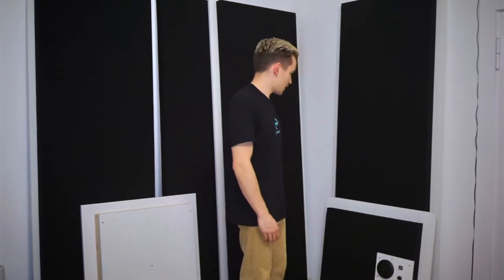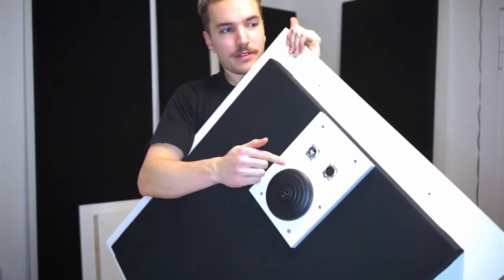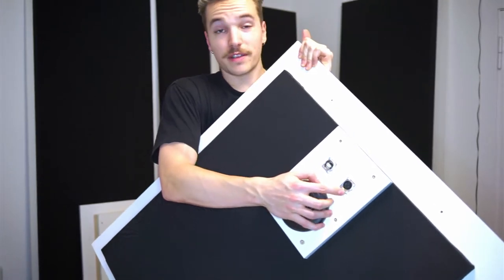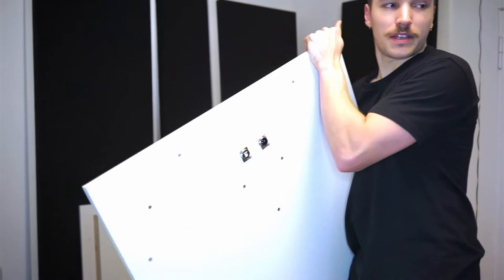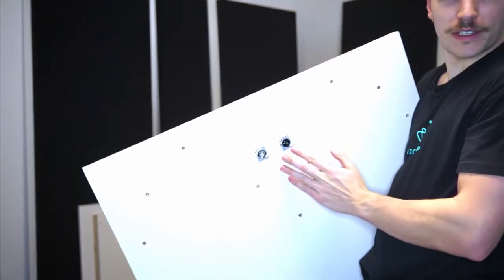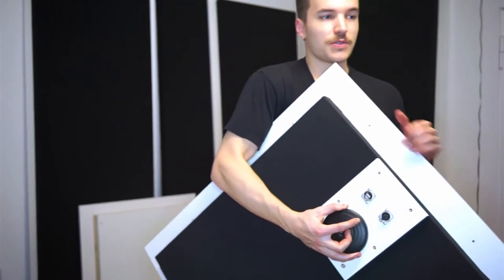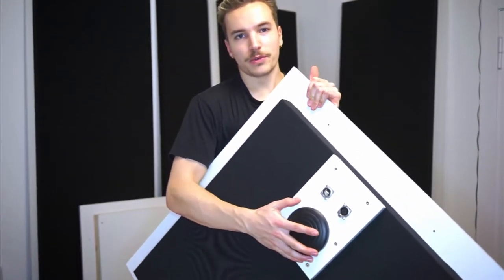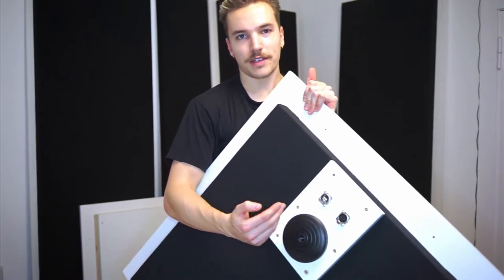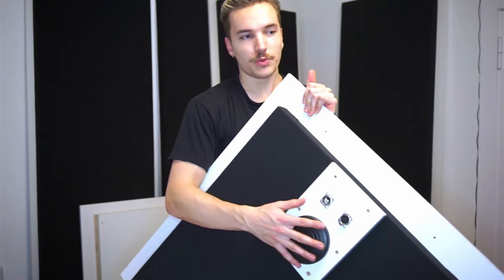There are just some final things that need to happen before assembly. I need to do some wiring for the ceiling — there's a microphone jack, a headphone jack in the middle, and a USB-A on the inside. On the outside there's a microphone output, USB-B, and a headphone jack. So I need to connect the two USBs to each other and the two microphones to each other so it passes through to the outside, where I can connect to my interface and computer.